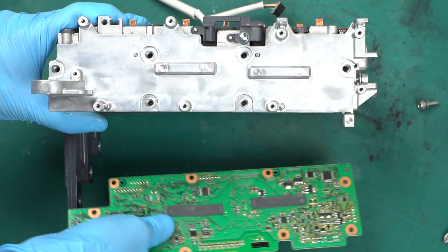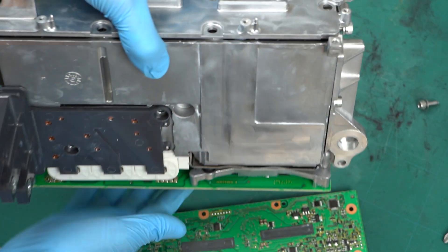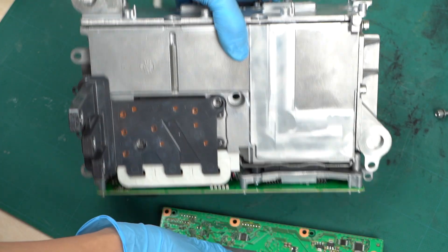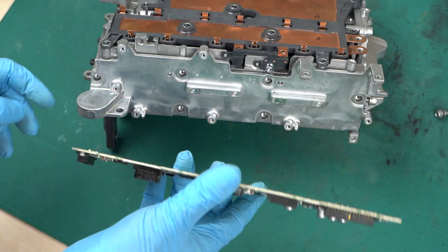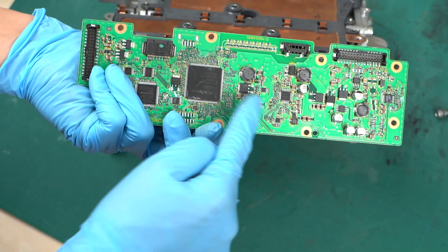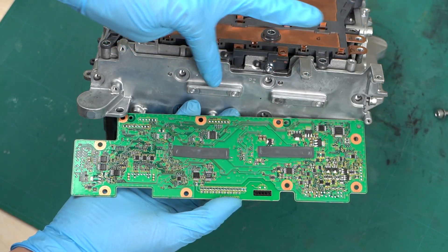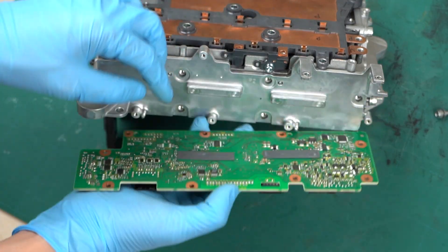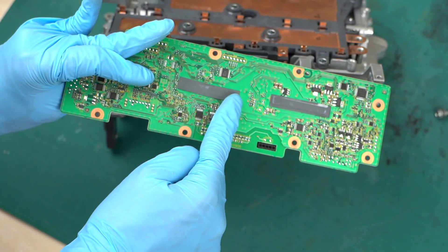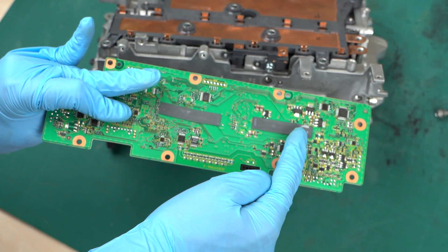If you take off the control board, it looks like this. This Hitachi inverter has a structure that is difficult to assume where the cooling water passes. The cooling water comes in from here and comes out from there. Microcontrollers are especially weak against heat, so the cooling water passes this area first. On the back side of the control board, thermal conductive sheets are attached with corresponding bumps — by attaching the board, you can release the heat. On the back of the microcontroller and power supply that produce heat, a thermal conductive sheet is attached, and on the back of the power control area, another thermal conductive sheet is attached.